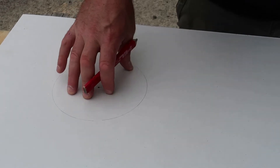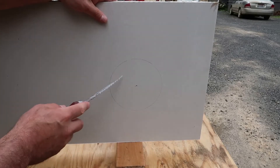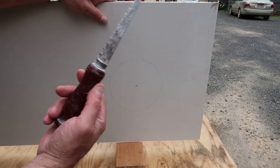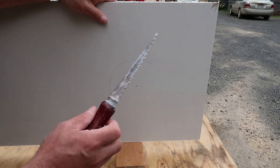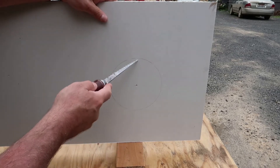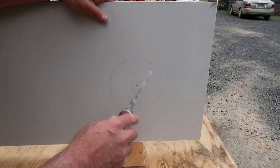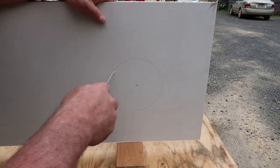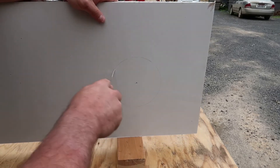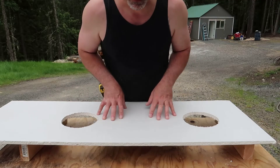Pull out the nail and there's your circle. I suggest doing this first so you can look at your pattern on the ceiling and see if it looks good to you. Once you're happy with the layout, I like using a drywall saw — it's much easier. Poke it through and stay on the inside of the line; try not to cut outside of it because you don't have a lot of room for tolerance. Now you've got all your holes cut for your lights.